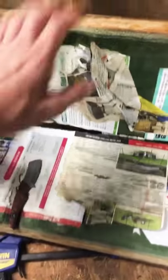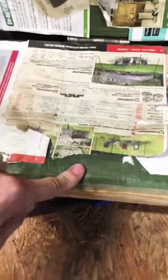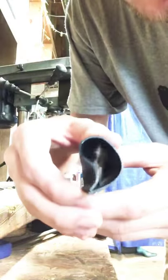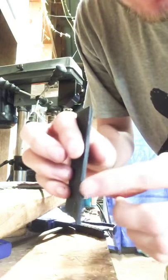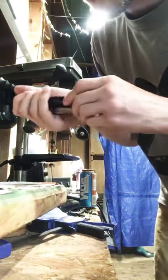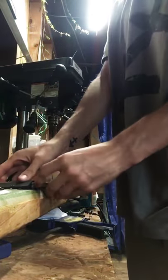Sheets are in the oven, we're about ready to press fit using my homemade Kydex press. This is just a camping mat with magazine paper over it so I don't get the pattern onto the Kydex. I pull the sheath out of the oven — see how it's all flexible like that. That would have come apart if I hadn't put the eyelets down. So I'm going to go ahead and slide the knife in and press it down.